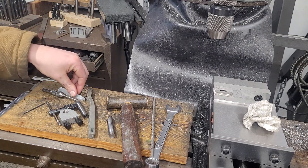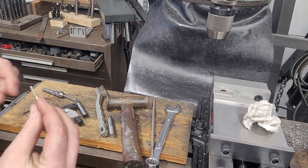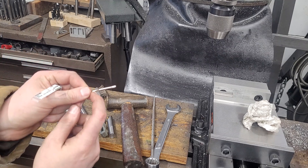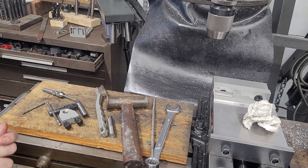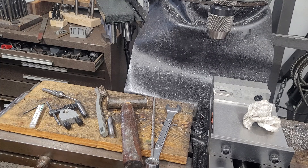We did a 4-40 tap into some O1 that was not annealed but not normalized, probably in the Rockwell C20s based on how it machined. And we did it first try, which is definitely a win in my opinion. What's nice with a lot of the 4-40 taps where they're necked down, I've noticed the ones I buy tend to break right at that neck, so they're pretty easy to grab with a pair of pliers and back out.